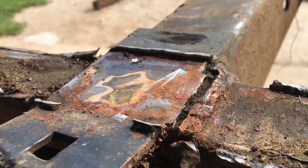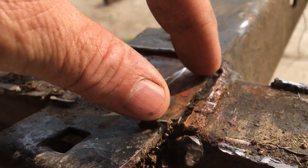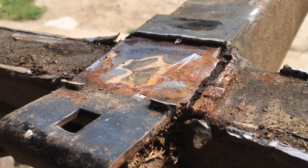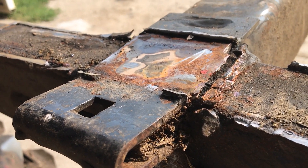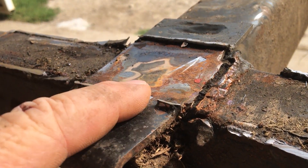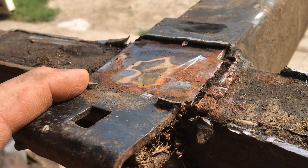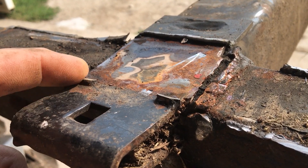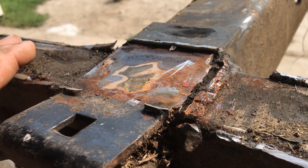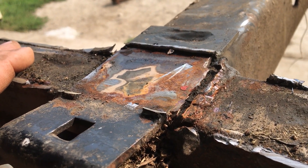So I think this time I'm going to cut out that little square there, and that will allow me to use a thicker material in my strap and then just butt weld this to that strap. But see how the holder goes all the way across the top of the bar — the bar is not strong enough to carry the curtain.